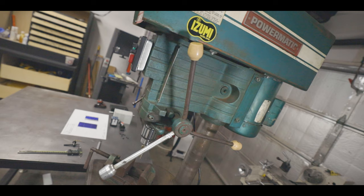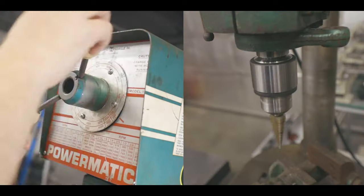It is the 120 or 240 volt single phase motor, depending on the way you wire it. And it is a 3/4 horse and runs at 1,140 RPMs. The crank on the front can change the speed between 330 RPMs and 3,075.